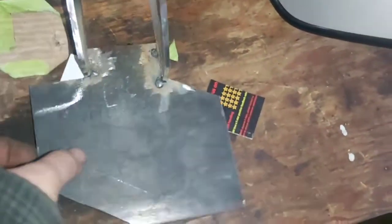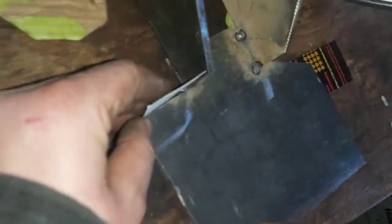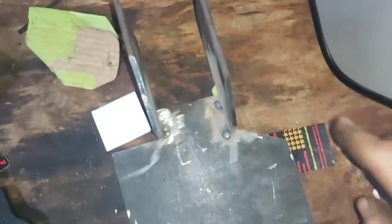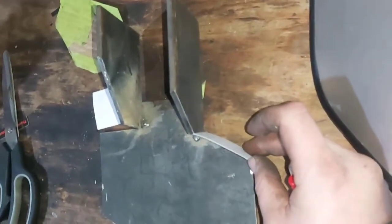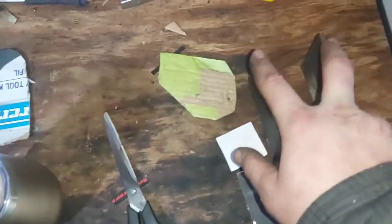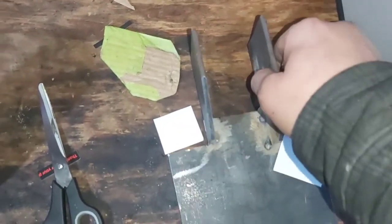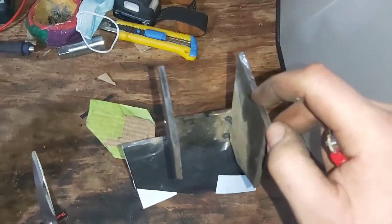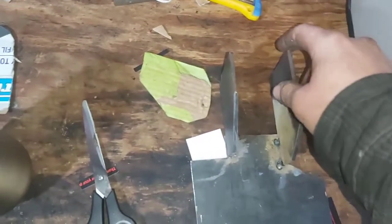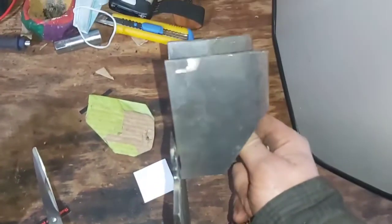I just lined up some pieces of cardboard, placed them in place, seeing if it was going to work. This isn't done yet — I've got to weld on some corner tabs for more support here, and that'll tie this area together. Same with this side. Depending on how much clearance I have back here, I was going to weld a plate across like this, but I might actually have to go on top depending on how far I have to come back with the D-series mounts.